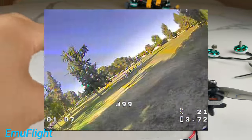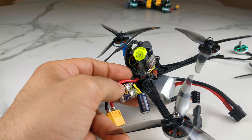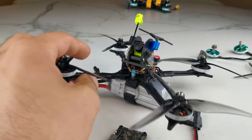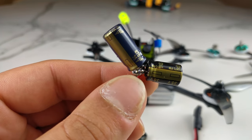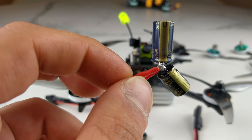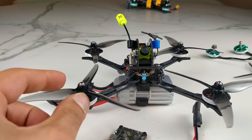I threw EmuFlight on there, particularly because we have a lot of filter tools and I have access to the developers, which helps me tune it. I've adjusted the filters up and down and the PIDs and just could not get rid of the flutter. I was still having a couple of little ticks here and there, which are usually indicative of vibrational noise issues, but without blackbox I can't figure that out — super frustrating. I added another capacitor — a lower ESR capacitor, even more responsive than the Panasonic one that's become the default. It really didn't solve anything.